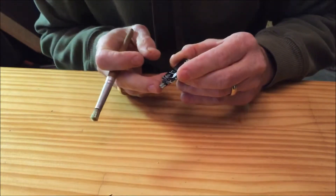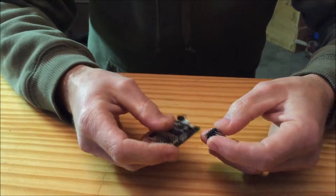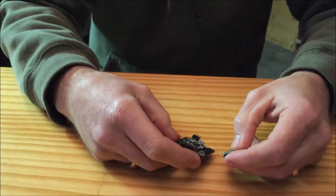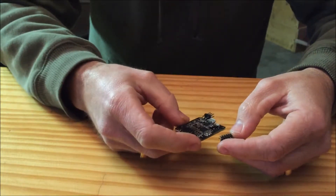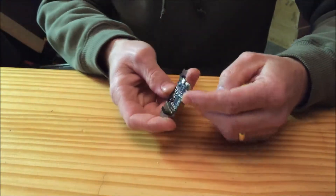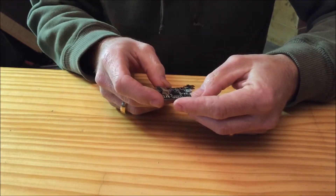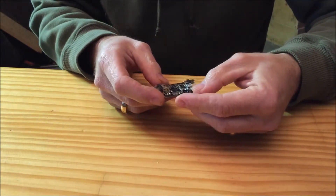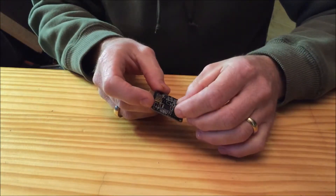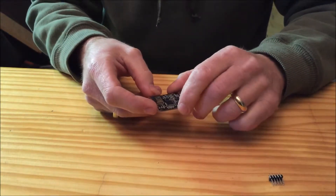I'm not actually using the receiver pins on mine. I'm going to be soldering the wires directly onto the board because I have a PPM receiver and I'm just going to be using ground, voltage, and pin one. I need to tin the connectors anyway, so I'm going to show you how to do this one because it's a little trickier — this one doesn't have holes to hold the pins in place, so I'm going to tin this ground pad on the end first.